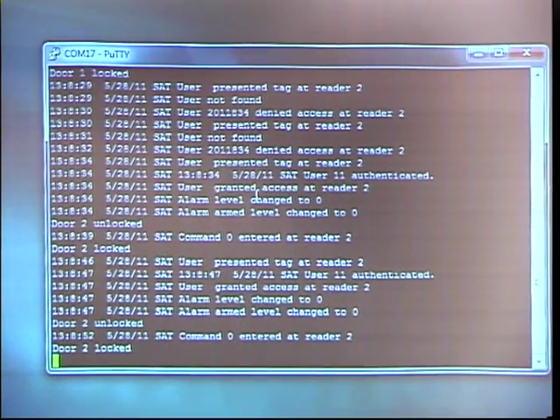Really basic, but it gives you the capability of directly internet monitoring or via cell phone or modem what you have. And we have those four relays, only two of which are used for the door. So one of those can easily go into our alarm system as well and trigger the alarm monitoring company.